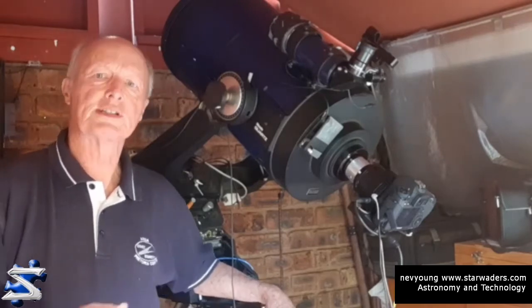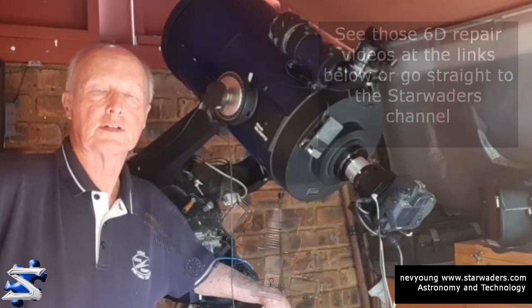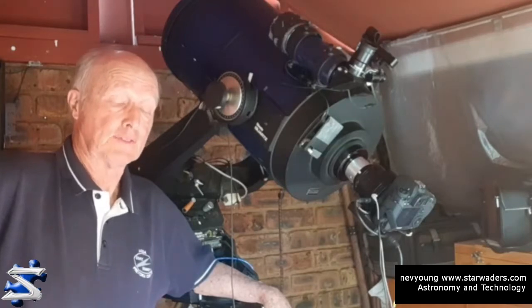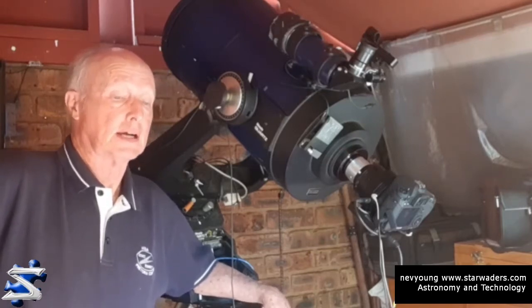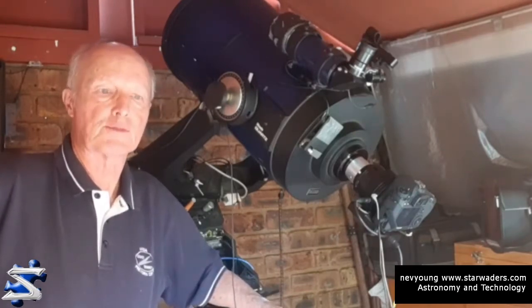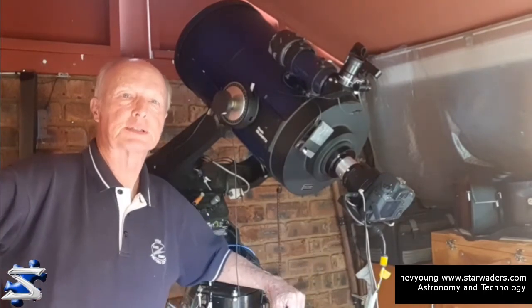Having recently made a few repairs to a Canon 6D astro-cooled camera, just like this one over here, Percy asked if I would have a go at removing the IR filter from his Canon 650D. Percy likes to remove the filter in the camera so that he can have access to a wider range of the spectrum. He wants to see down into the longer wavelengths where there are two calcium lines in which he is particularly interested.